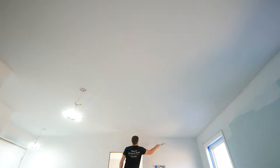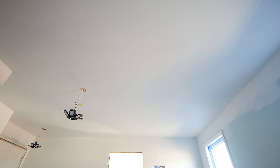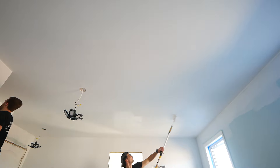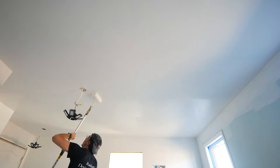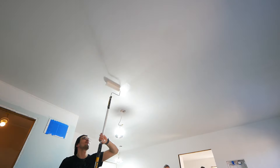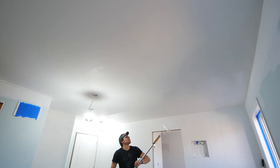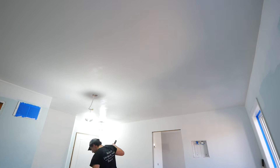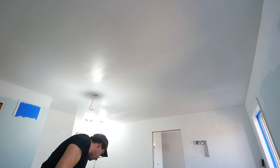We're now at the point where we can paint our ceilings, and for this we are using Sherwin-Williams Premium Ceiling Paint with a 10-millimeter nap roller. We cut in all of the corners, and because the walls of this room are getting painted too, we can kind of cut down from the ceiling onto the wall a little bit. We do like to take a fan sometimes to move some air in the room as it helps with dry time. After the first coat has had ample time to dry, give it another very light sanding and then finish it off with the second coat.